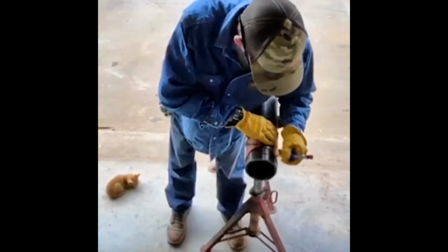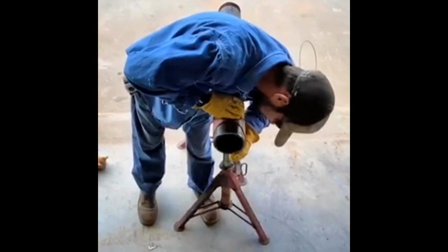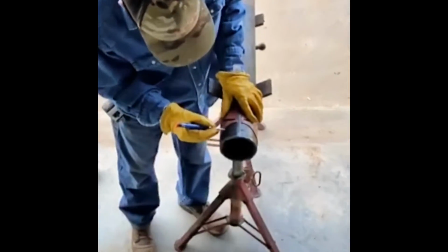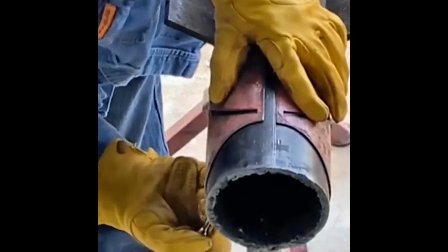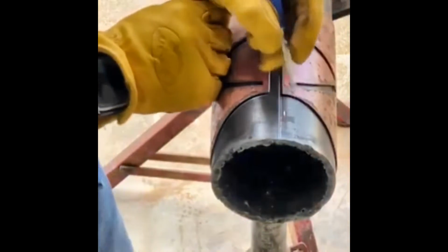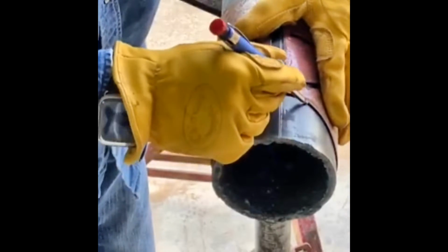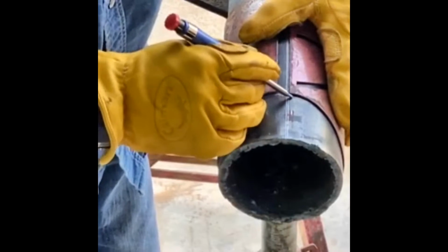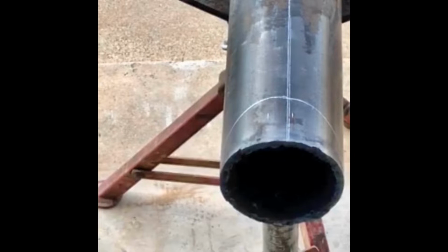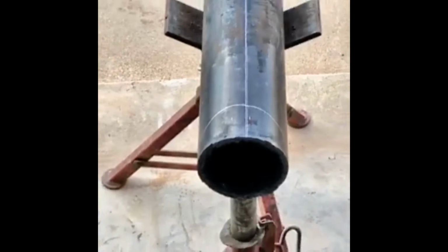One thing you might be doing wrong is rolling your pipe and cutting a saddle bevel square, and that causes a problem because then you got a big, what we call a landing, that you got to grind off. You'll keep your torch completely straight when you're doing it. Feather the edges off, all you got to do is bang it on it and it should fit.